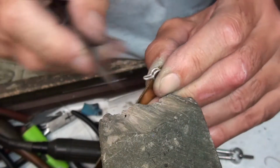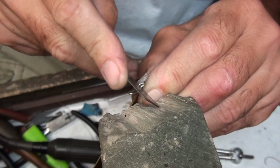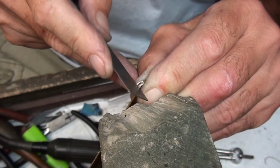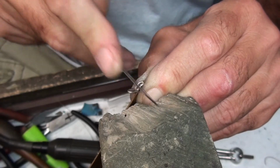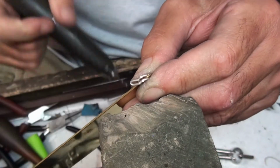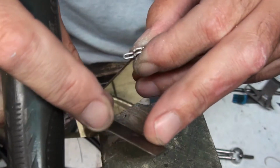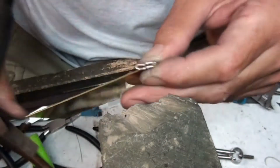You don't see this much nowadays in the jewellery industry, but in my day when I was a student, we used these for cutting the grooves in for claws all the time. So I can't expect that you got one of these, but this makes a nice bed for the claws, and the thickness of that was 1.2, which is the same as the claws. So you can see there's teeth on the very edge, but none on the face there and there.